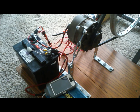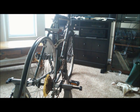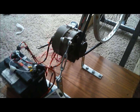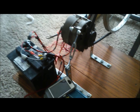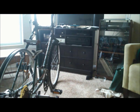What's also different about this one versus others I've seen is I have an old lawnmower battery in the system. That's really nice because when you're pedaling and you put a load on it — like with a TV — you're charging the battery, but the item you're using is drawing power from the battery and not directly from you. When you're drawing more load, there's more load on the alternator, but having a battery of at least lawnmower size in the system greatly minimizes that load. It also helps keep a consistent output voltage so your voltage isn't spiking around and you're not damaging whatever you're powering.